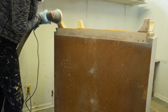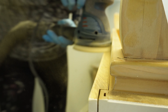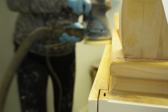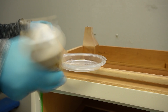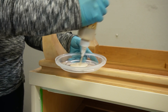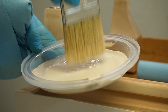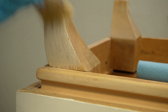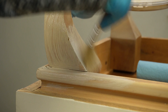I really liked the look of the bare base and legs in contrast with the Drop Cloth paint, so I decided to keep them looking very natural. I sanded down the existing finish on the feet and base, then used Dixie Belle's water-based Au Naturel stain. It's super easy to use — you can thin it with water since it's water-based. I put it in a little plate, applied it with an inexpensive chip brush working in sections, then took a blue shop cloth and wiped everything back to give it the natural wood look.